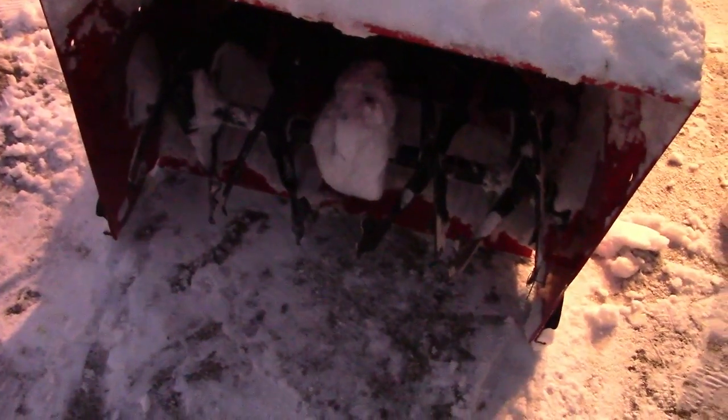The snowblower did just fine. That's actually the gear case that's covered. After the belt tightening, it worked great. In fact, it worked a little too well. See the auger and the little sharp kinds? Apparently I had a little problem over here, because I came down here and the snowblower kicked up and actually put a gash in that. How that could even reach that, I don't know. It looks like it doesn't even extend past it, but I guess as it rotates around it just has enough meat to get in there.